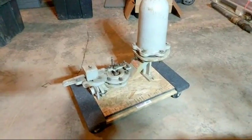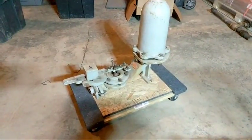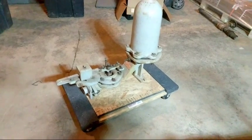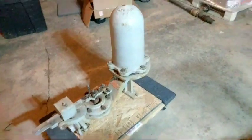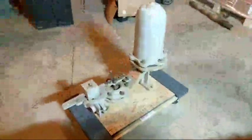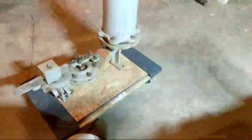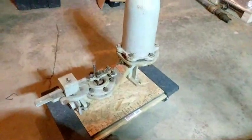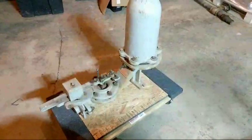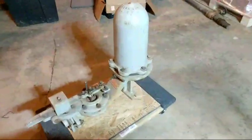I had it installed in North Carolina and there was nothing wrong with it, but the snifter wasn't adjusted properly. And I'll talk to you about the snifter here in a little bit. So I'm gonna have a little hydraulic ram pump class here tonight, going live, just having fun. But all these 6 bolts on here completely broke. They're pretty good sized bolts, 1/2 inch bolts, and it busted them all, because the ram, when it's not adjusted properly, will tear itself apart. So that's one of the rams I'm going to show.